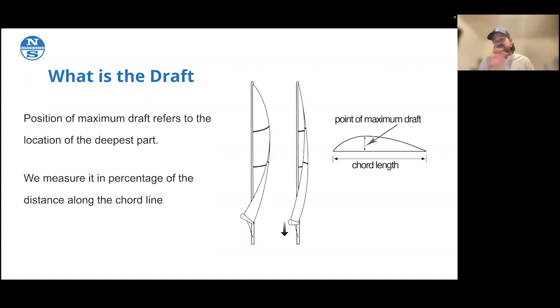You can see on the right side the arrow's been pulled down, where either the gentleman or the lady has pulled on the mainsheet or pulled on their boom vang. What that does is it tightens your leech and closes it. So those are two types of twist. The left would be an open, twisty sail and the right would be a closed sail. And depending on the conditions, either of them can be a correct trim.